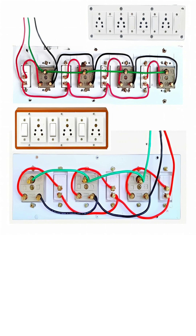You can also notice jumper wires, which are small wires used to connect the same terminal points of multiple switches or sockets. This avoids the need to bring multiple wires from the distribution box, making the wiring cleaner and easier to manage. Additionally, tightening screws hold the wires firmly in their terminals. Loose connections can cause sparking, overheating, or short circuits, so ensuring strong mechanical contact is a must.